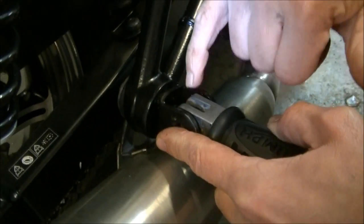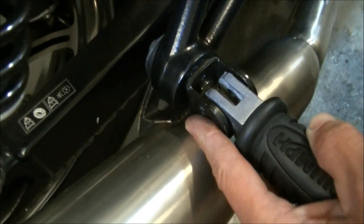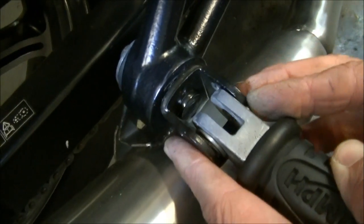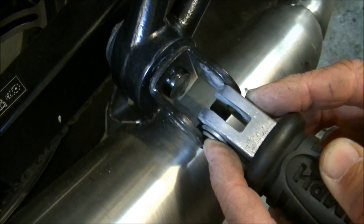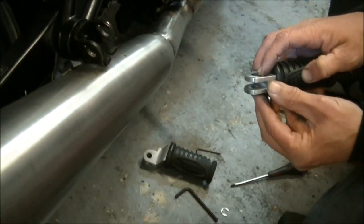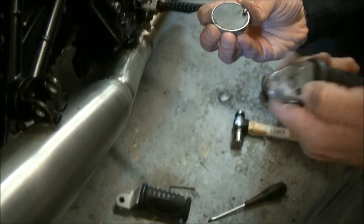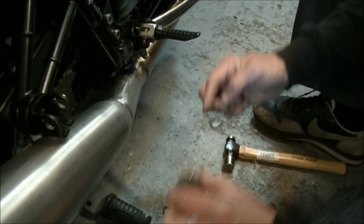The spring is on the other side — so the spring forces the entire clevis assembly across this way. Just put your finger in the way in case it goes ping. Finger on that side — there's the ball bearing — and finger on the spring there, and out it comes. Put the spring to one side. To get the ball bearing out, use the magnet — easiest way in the world, just lift it out. Because if you try to lever that out, you'll ping it and it will disappear forever.